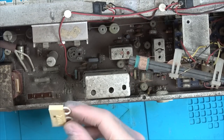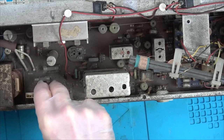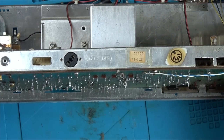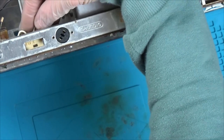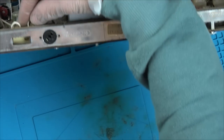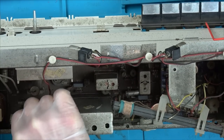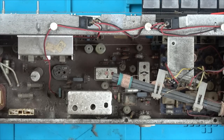So it's at 220 volts while it's on that jumper, and that jumper. But when we do that, you can see that we can actually read 220 volts through here. When I push it down, you'll be able to read it. But look, if we were to put it on the 110 volts, and use the same contacts, there, and there, you're not going to be able to read 110 volts. It will just say 10 volts. So you need to put it on those contacts, those jumpers there. And if we put it on those jumpers and push it down, you will then be able to read 110 volts. So that's how you do it. You just jumper it there. Again, that would be done at the factory, depending on the destination of the device, you know, UK or Europe, America, etc.